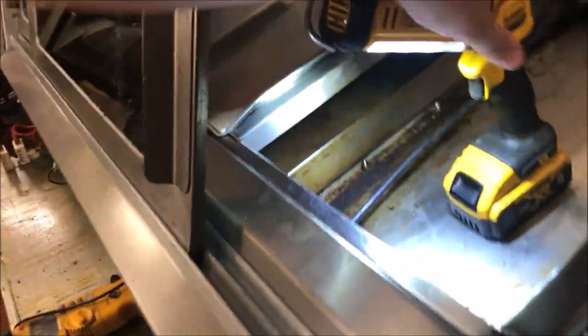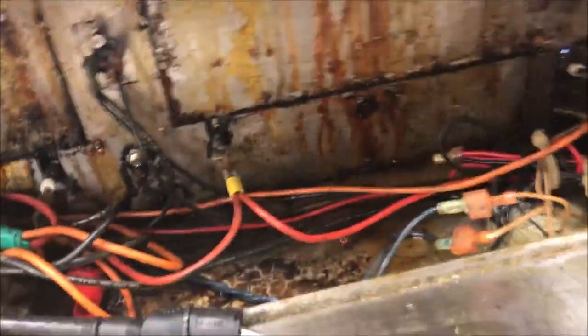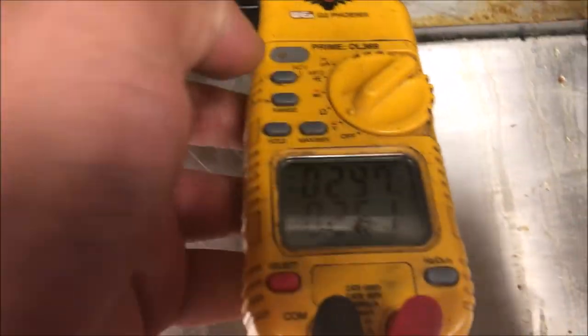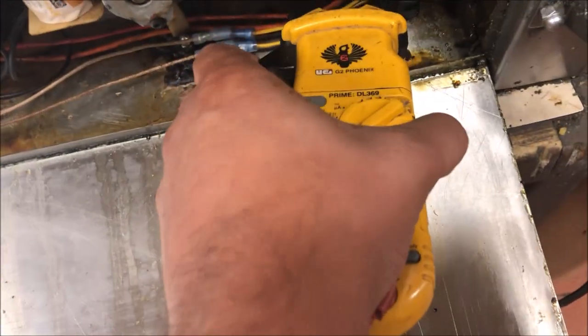Let's take a peek inside - move some trays out of the way. You can see that it's supposed to be screwed in but the screw is missing. Probably when cleaning this thing it shorted out. We can snap it off the frame - there we go - and you can see the arc mark right there. We're going to need a new element. I disconnected that element and fired up the unit - we're getting three amps on the elements, so we're good there. We'll get a new element. The far right blower motor and this contactor I'll change as well, but we found the dead short. We are all good here.